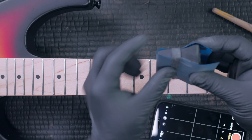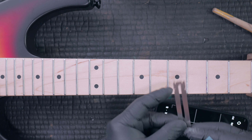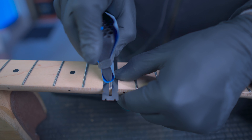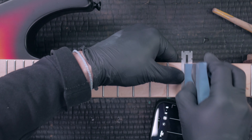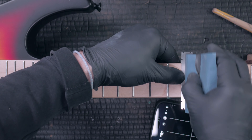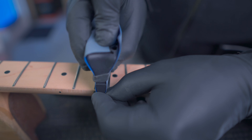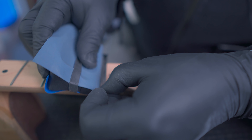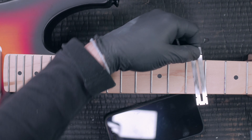It has a little notch for the rubber band to sit in, and I'll use the fretboard protector so I don't need to tape off the board. I angle the tool to get the top and the sides — doing the entire length of the fret — really laying it on the fretboard to try to get that corner of the fret. Then we move up a grit.